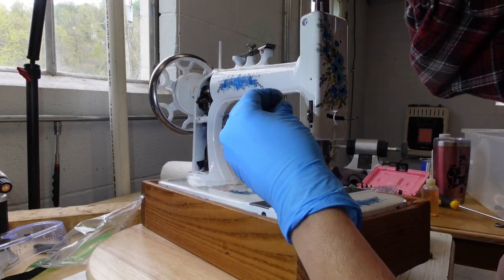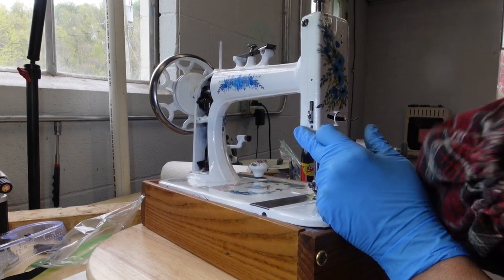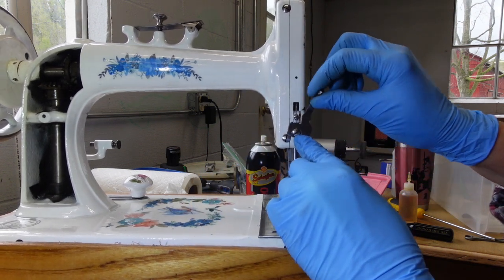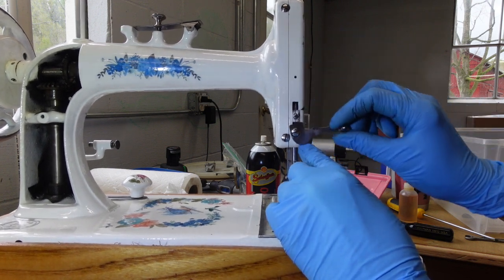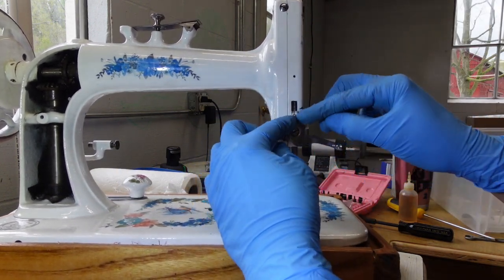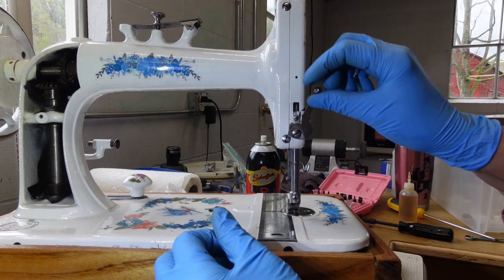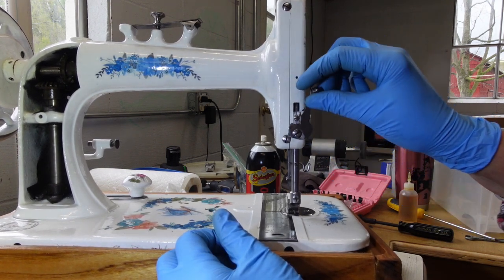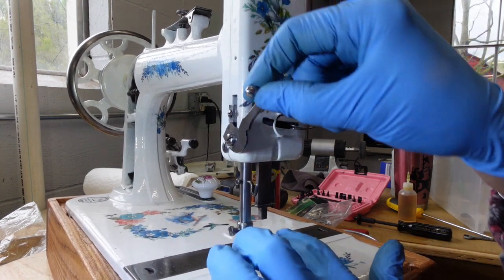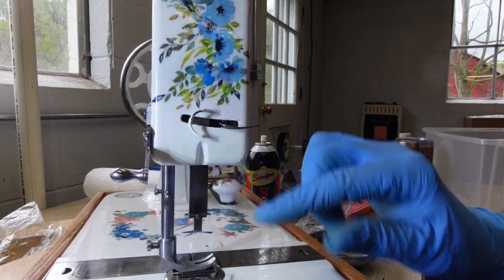I'm going to go ahead and put these two side screws in. They are much shorter, top and bottom right here. I've put this little screw with the presser foot lifter on, and it goes like this, so that when it's down, it's not totally down. Before this is on, this piece can actually go farther down. But this is the down position, and that's the up position. Okay? So I am going to need to adjust the presser foot, though, because the down position doesn't even touch the feed dogs at the highest point down here, so I will need to adjust that.